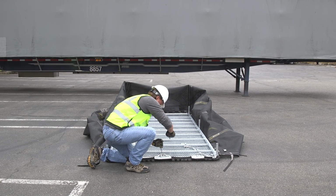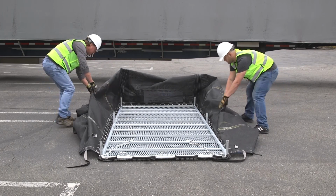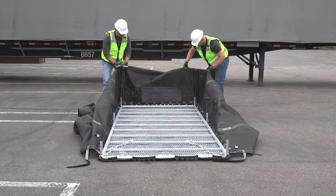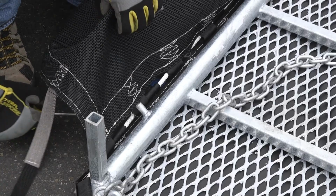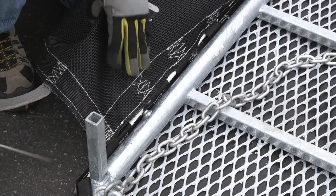Make sure by pulling on the side panels that no material is caught underneath the bottom section. Also, perform this at the back, making sure the back corners have not slipped underneath the bottom section while securing the front section. The connecting line has to be raised over the 6 securing pegs by sliding a screwdriver underneath the white securing line in between the side panel and bottom panel. Raise the securing line and side panel over the securing peg.